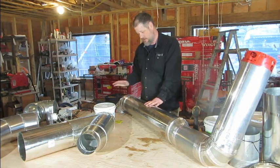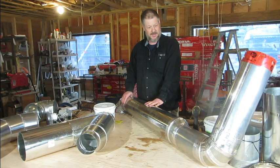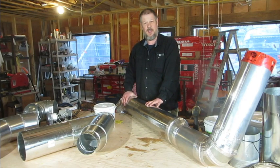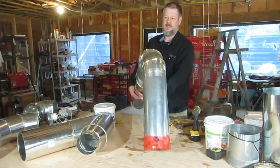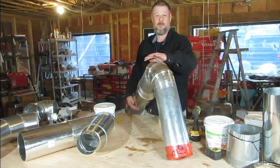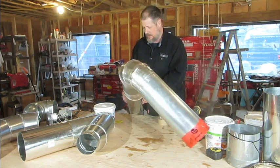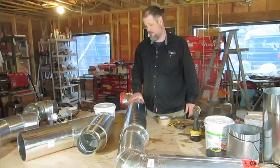That basically shows why it's so important to seal your ducts — you want your air to go where it's planned to go, not wherever it feels like going. It doesn't take a very large hole for there to be a large movement of air out of an unsealed joint. The practice of not sealing as you go, sealing only after installation is complete, and not being able to reach the top side just isn't going to cut it with a high-performance system. I'll come back a little later to demonstrate sealing up a Y-fitting. Thanks.